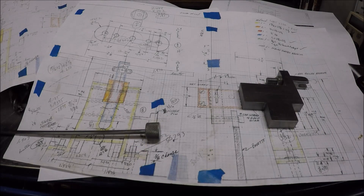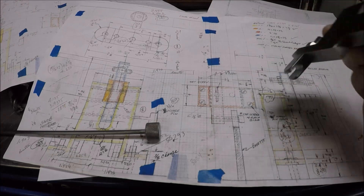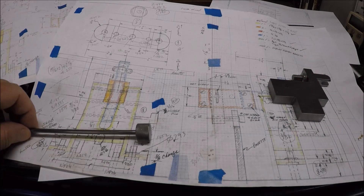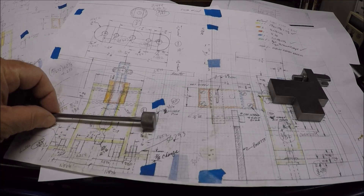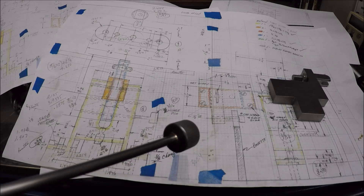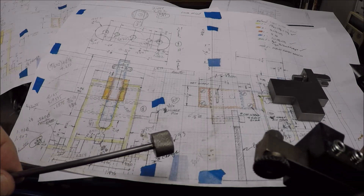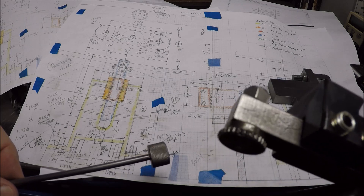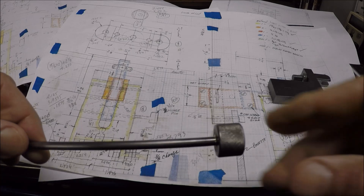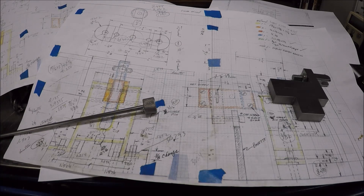Quick update: this piece sits right here and it rocks — that's the earlier piece, all completed other than drilling some holes. This hinge pin I made this morning. I have to give a shout out to Keith Fenner for the silver solder lessons on his channel. Also This Old Tony — he's a fan of the straight knurl and I've had this straight knurl tool for many years but never used it until today, and it turned out real sweet. Got the hinge pin done, left it long, and we'll cut it to fit.